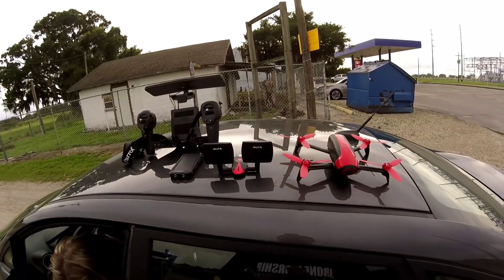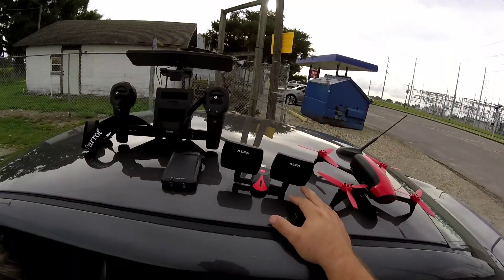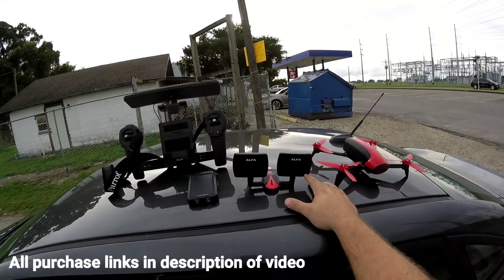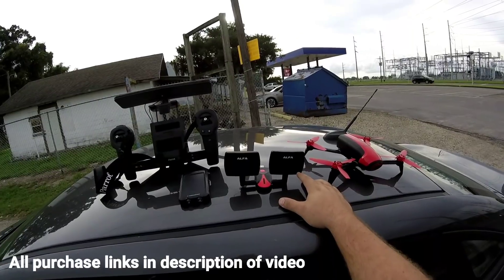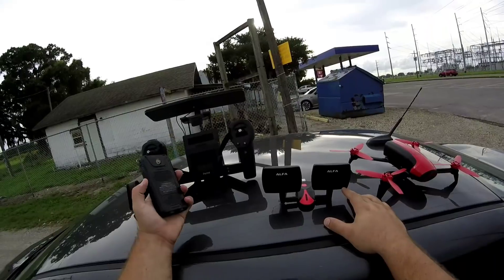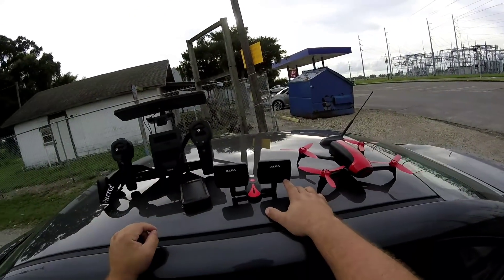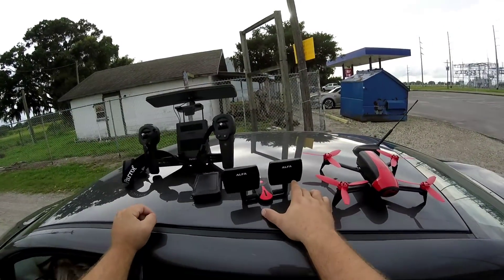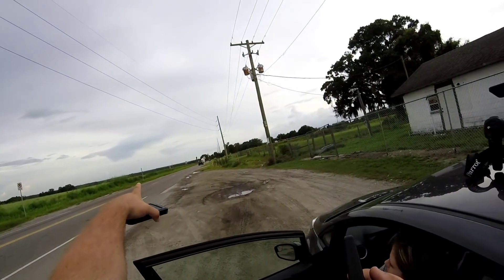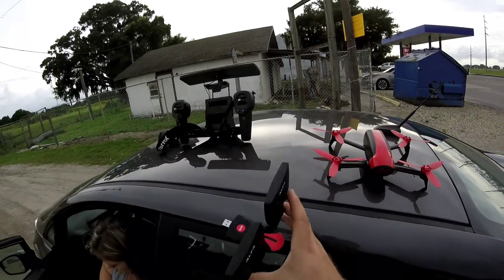What I have here is a little bit of my own design — this is the WPS Wi-Fi repeater. Instead of the stock 2dbi panel or 2dbi omnidirectional dipole antennas, I decided to slap my 3DR Solo Alpha 7dbi antennas on there. I'm going to be using this 3000mAh power bank with a 2-amp port, and we are going to see exactly what kind of range we can get. I'll set this on top of the car and fly the Bebop straight out using nothing but phone controls.